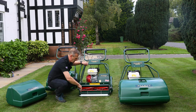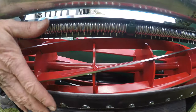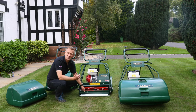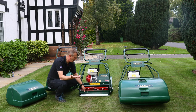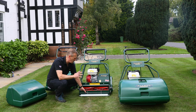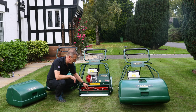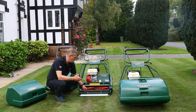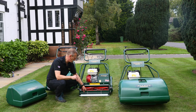What I love about this machine is the rake. The rake fits just behind the front roller and helps comb the grass. It stands grasses upright, including those low-lying flat weed leaves, and presents them to the bottom blade ready for cutting — much better than if that comb wasn't there at all. It's fully adjustable on two screws so you can be as aggressive or as lifted as you want to get the result you need.